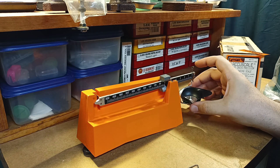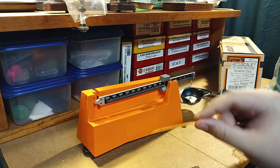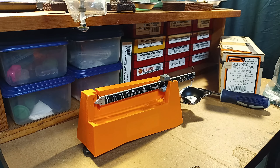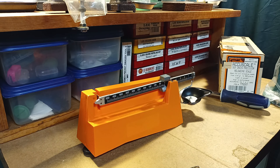That's also at zero and we're back at zero again, so this does work. For the cost of a chunk of paper clip and a little bit of super glue, it worked. Their complaint was that it would drift over time, and you can see they bought it new and it sat in the box so long the sticker actually came off. I believe that somewhere in shipping the little pin fell out and it's just been sitting in a box ever since because I never trusted it. So if you get a scale like this that keeps drifting, just give it a once-over and see if there's a tiny pin missing. Thanks for watching, hope that helps.